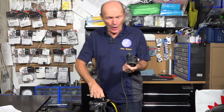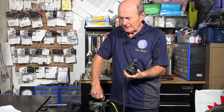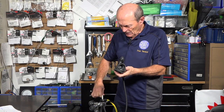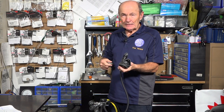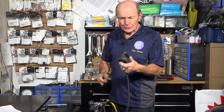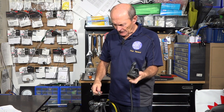We're going to start increasing it like so. All we're really doing is increasing the pressure on the spring underneath this adjustment nut, and that spring pushes on the diaphragm down, which pushes the needle and seat down, and lets more air in. Starting to free flow. Well, that certainly makes it easier breathing — a free flow means it's flowing all the time, you can't get any easier than that. Of course, you're also losing and wasting an awful lot of air. See how sensitive it is? Just giving it a shake and that little lever in there — a light piece of metal — and now it's losing a lot of air. That is not good.